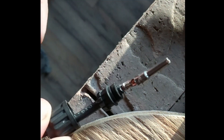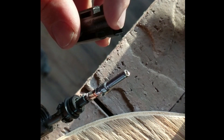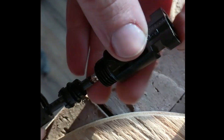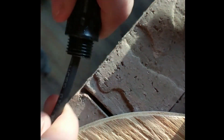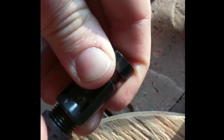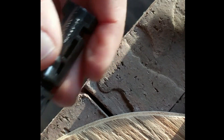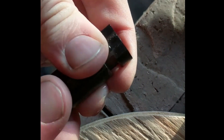I already put this — it has a little grommet on there, and also the threaded end. So now I can just put this in. This is the smaller stinger; go to the more open part. You'll push this in and it clicks a little bit — push it in until it clicks — then we'll go ahead and tighten this down. This keeps water out; it's like a watertight connection, but the actual copper crimp we just did is the strength connection part of it.